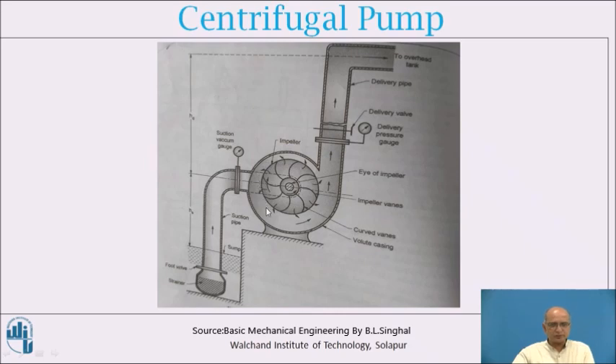This volute shape is required to increase the pressure of the water. The principle is: when liquid passes through a convergent zone, velocity increases at the cost of pressure. In reverse, when water passes through a divergent zone, kinetic energy is reduced and pressure is increased. The divergent zone exists both within the impeller and as the water travels in the anti-clockwise direction through the casing. This is the working direction for the pump.